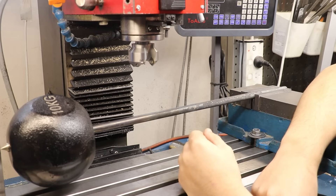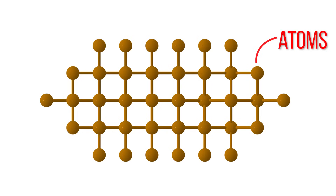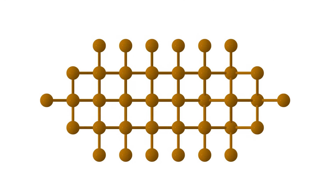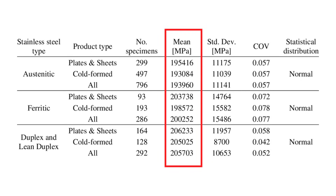So to end this video, I'll finish up by answering the question: why is it unaffected? Why doesn't heat treatment change the stiffness of the steel? The reason simply comes down to the fact that stiffness is primarily determined by the bonds between the iron atoms. The atoms are holding each other together, and when you apply a load, it's those bonds which are going to be pulled or compressed — and the bonds themselves are not affected by heat treatment. With all that said, changes to the composition of the steel itself can affect the stiffness. Cast iron for example is generally going to be a lot less stiff than steel — it can easily be 25% less stiff depending on the type. Most steel alloys, even alloys with more than 10% of other elements added in, are rarely more than 5% stiffer or less stiff than any other alloy. Most steel alloys fall within about 190 to 205 gigapascals.